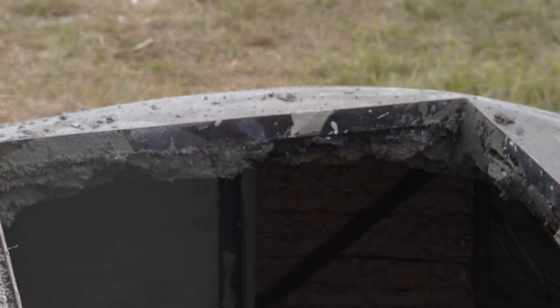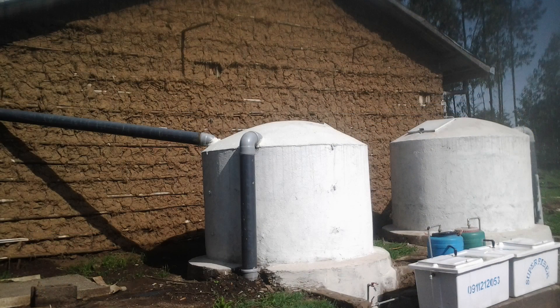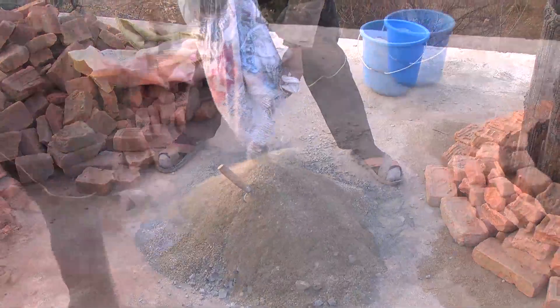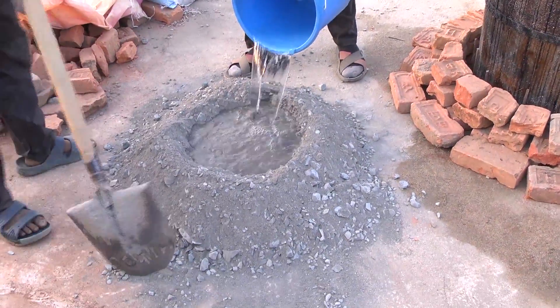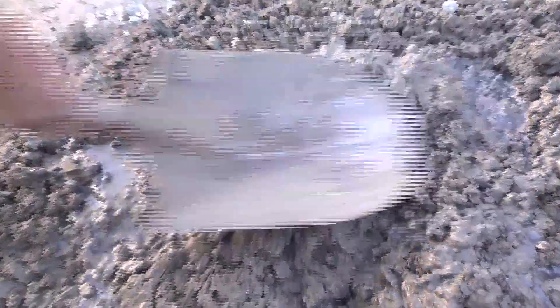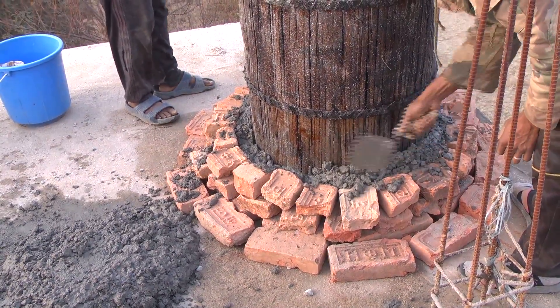Finally, if you're using your tank as a rainwater collector in a rainwater harvesting system, you should also prepare two further holes: one for rainwater inlet and another to allow for outflow of overflowing water. Once your bamboo frame is ready, all that is left to do is plaster the tank with cement. Firstly, regardless of the size of your tank, the bottom edge of the tank is plastered with any gap between the tank and the foundation filled with concrete.